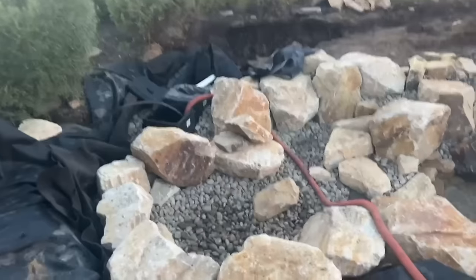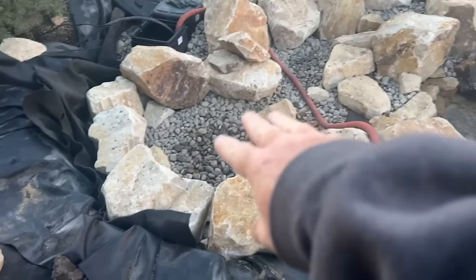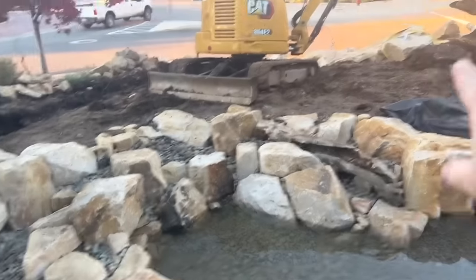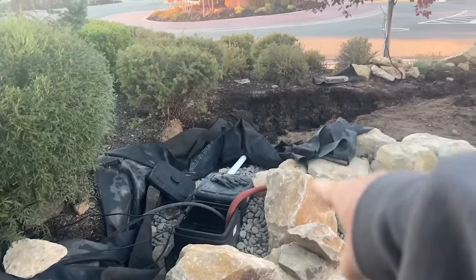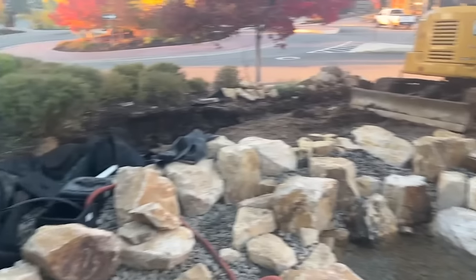So this is the 1300 gallon intake bay. You can see our pump vault back over there, aqua blocks down below, all that water's coming in. This is basically all buttoned up. We got our plumbing run back over there. You can see a bulkhead fitting through the liner over in that spot. I still have to do an overflow over here, so we gotta figure that out pretty soon. Yeah, that could be challenging.